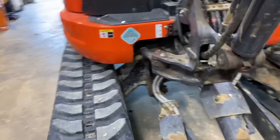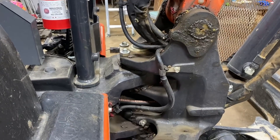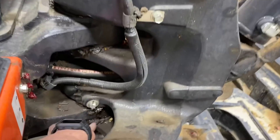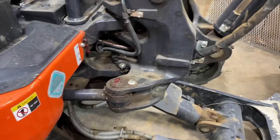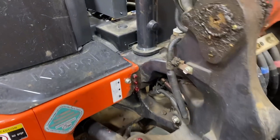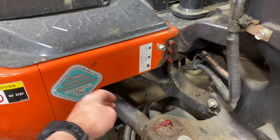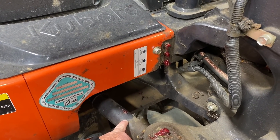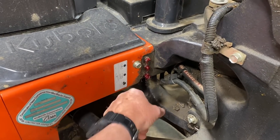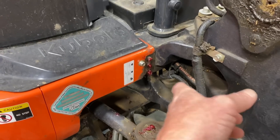Because it started there Friday afternoon. They could easily drill and tap — that'd make a lot more sense, and it wouldn't be in the way of anything. You could still get right there and grease that too. Because this right here greases one of them — greases the end of the cylinder right there. And the other one greases the swing bearing and then the gear right there. And that's what those three do.